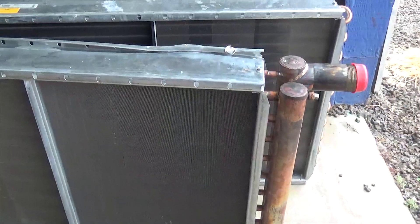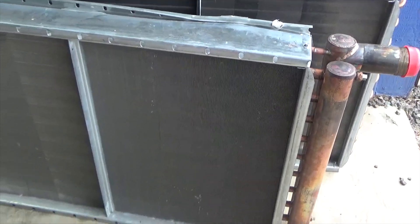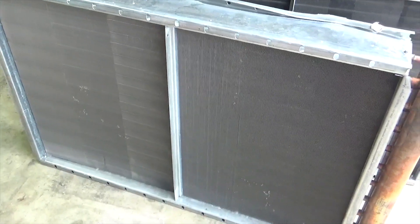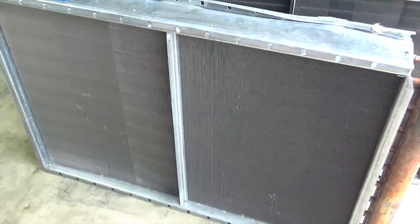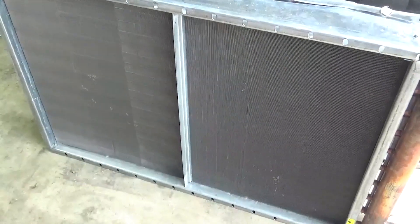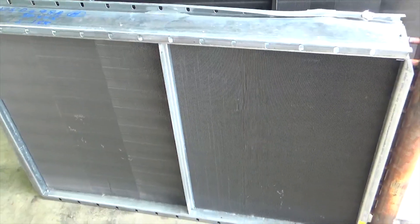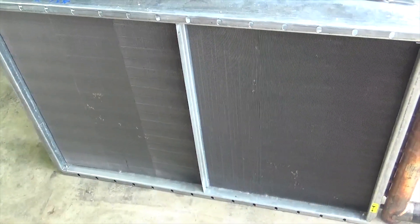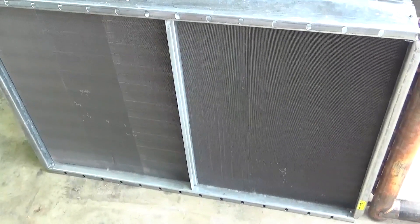For the radiators, my original intention was to use a large truck radiator from a semi truck. However, I found these two units on Craigslist — they're actually air handlers from a large air conditioning setup. They're brand new and a nice gentleman sold them to me from his church at prices that can only be described as charity. They measure about three by four feet, have a nice depth, a lot of copper, and I think about a quarter horsepower of fans will move enough air to keep the oil nice and cool.